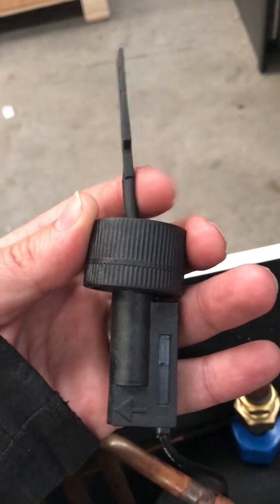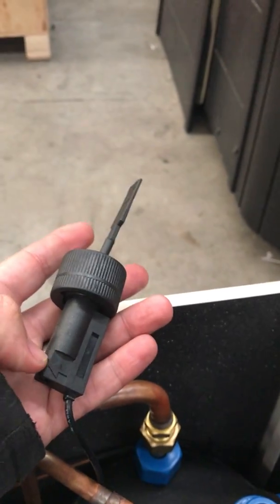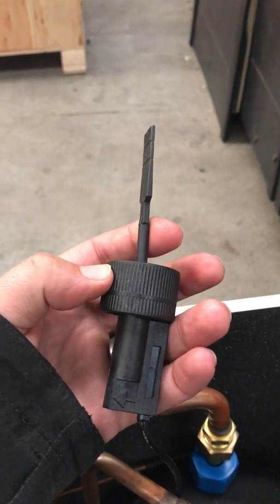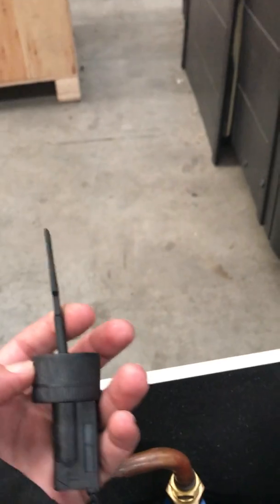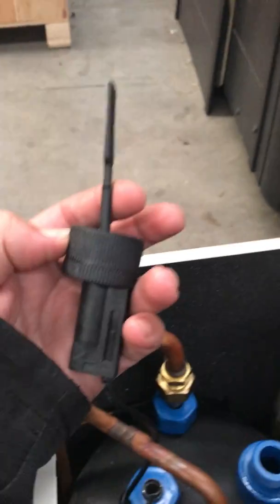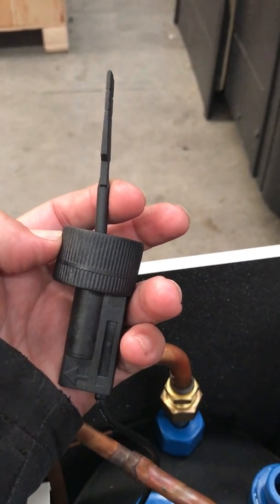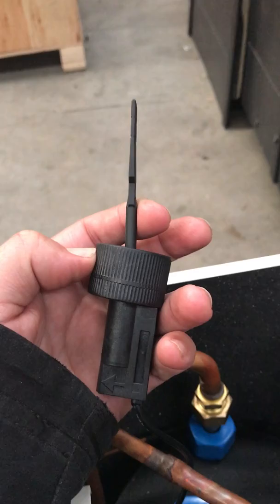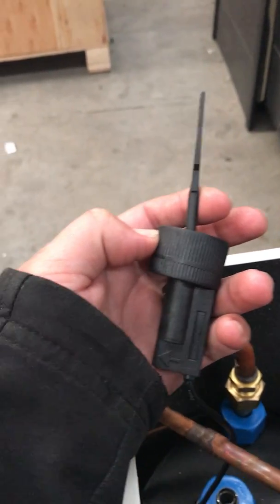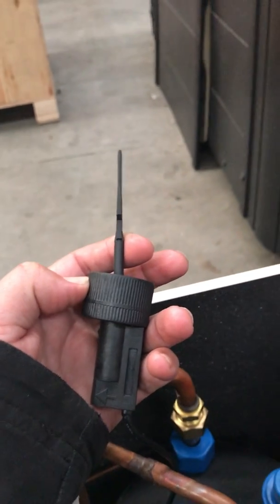So if you can push the paddle in the direction of the arrow, which I don't know if you can see down the bottom here, push it like that, turn the spa on and run it. The error, if it's going to error, should occur within 60 to 90 seconds. So run it for 2 minutes and see whether that error comes up. If it does, possibly an issue with the flow switch, likely to be an issue with the flow switch.